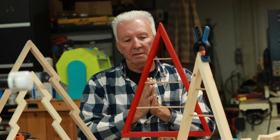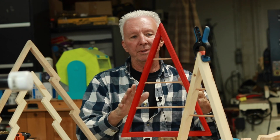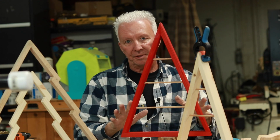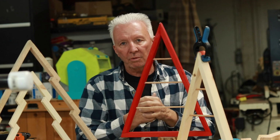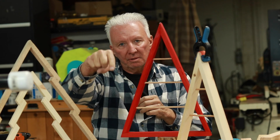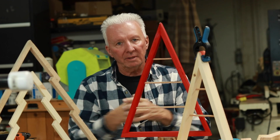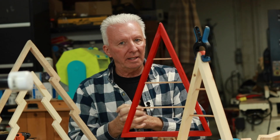You're going to need a 1x2x96, that will build both of these Christmas trees. You'll need 1 dowel rod, 48 inches. These are 1/4 inch. The cut list will be in the description below, so check out down there. I will have a list, but understand that it is a guideline.